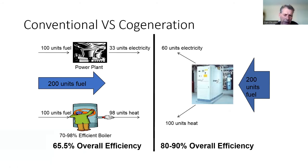So I've debated many times with mechanical engineers that, pardon me, may or may not be familiar with these systems. So they'll say, well, I got a 98% efficient condensing boiler. And that's great if you have a building designed for that. I've seen lots of condensing boilers put in place because, well, the 98% efficiency was really sexy, but the building's not designed for that condensing boiler, and so it typically would run maybe at 80% efficiency or whatever. Lots and lots of non-condensing boilers that are designed to be 80% or 70% efficient. And as they age, it's not uncommon to see boilers operating at 60% efficiency.